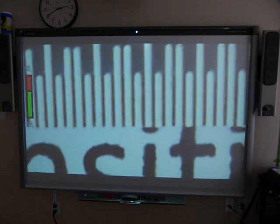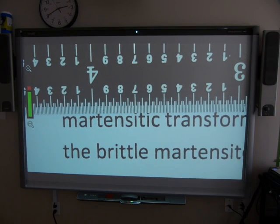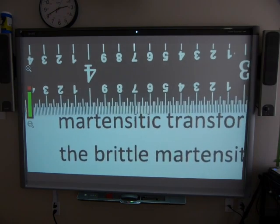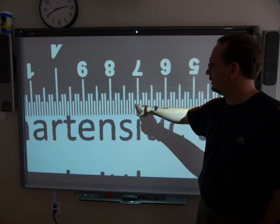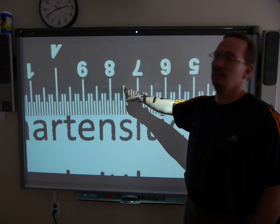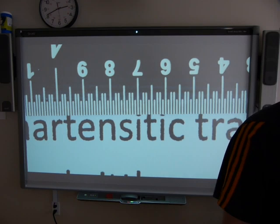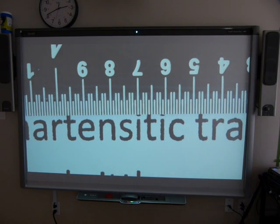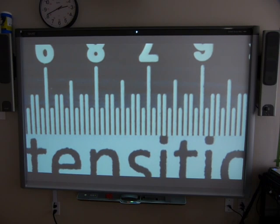Measuring the size of a dot on an 'i' is extremely difficult to take an accurate reading on a ruler with one hundredth of an inch, but that would be the idea. You can see the numbers — even though they are upside down — so that's 0.70, 0.71, 0.72, 0.73, 0.74, 0.75 (five is a little longer), 0.76, 0.78, 0.79, 0.80. The numbers are small and extremely difficult to see, but the math in reading the scale is fairly straightforward.